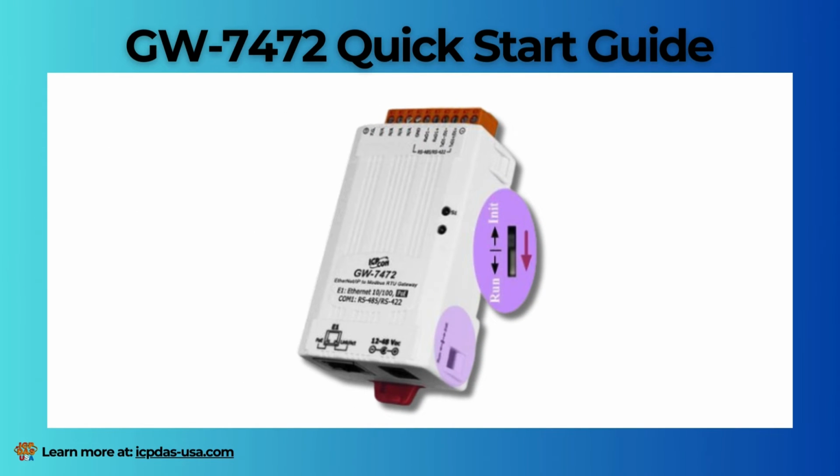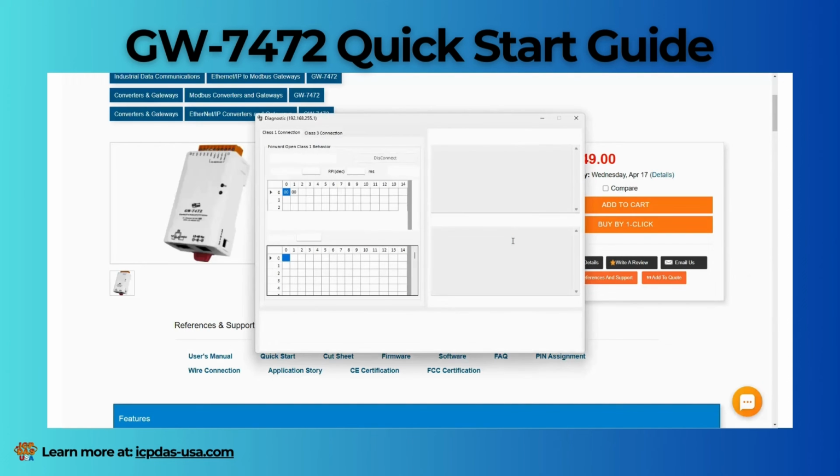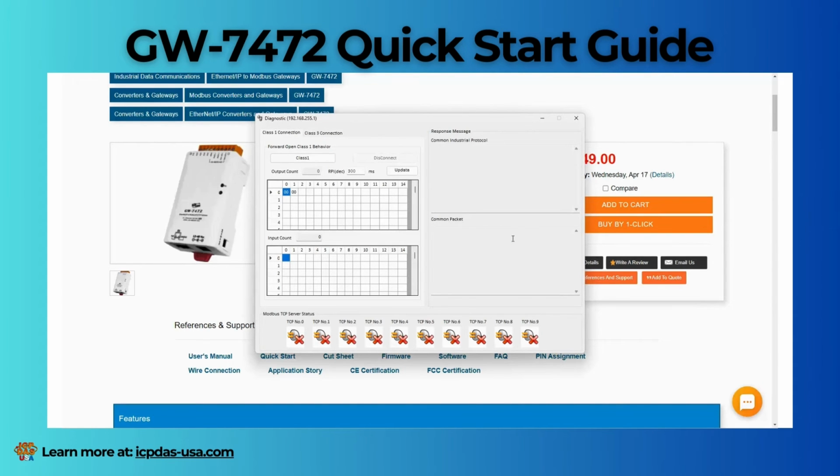To run a diagnostic test on the module, you'll want to ensure that the INIT/run switch is in the run position on your module. And once your module has completed the reboot from the last part, you can then reconnect it with the utility, then click the Diagnostics button, and the test will run. Once this is complete, you have successfully set up your module.